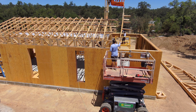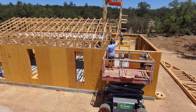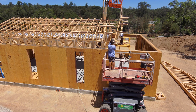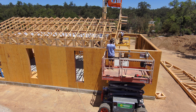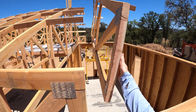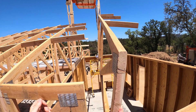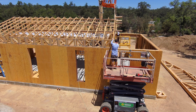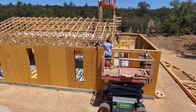We fast-forward a little bit here now that dad's got the truss closer, so I can describe what we're doing. Basically he's just lining it up for the last few feet. I could grab one end, Sharon could grab the other end, and then we could land it on the top plate next to the previous truss — pretty close, really, between the slack and the ties from the top and him positioning with the boom. We could usually get the truss to set down within about a half inch on the top plate, and then just hammer it into position from there. It wasn't too hard — the total time to lift each truss, drag it over, and set it down was really only about 10 minutes or so.